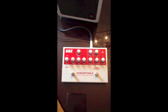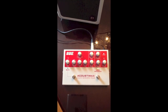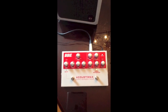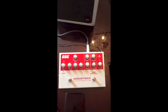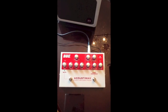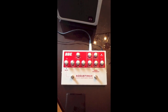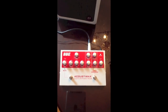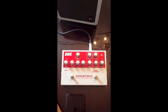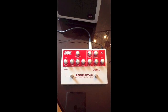That really helps. So you've got a bass and treble, and then the gain knob, obviously you've got to have that. The mid again helps, and on the far right side is your final volume. You'll see I run the gain a little lower than midway and crank the volume up a little bit. That gives me just a nice warm sound, but not even a bare sign of distortion. It stays really, really clean.